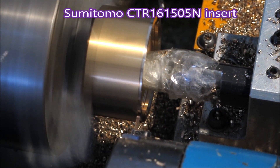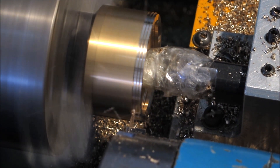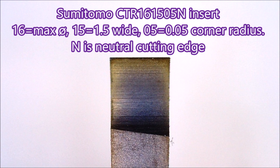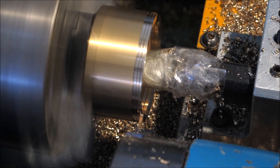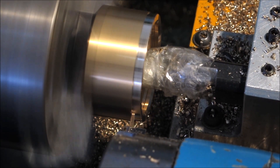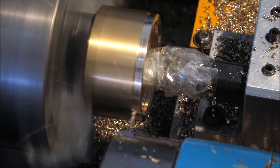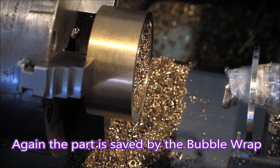You can get a better look at the parting tool at work — that's the insert. You can see there's almost no radius on the edges, very sharp, ideal for small lathes like mine. You see the ring being parted off again, and you'll see again why the bubble wrap was so important on the boring bar. Thank you for watching.